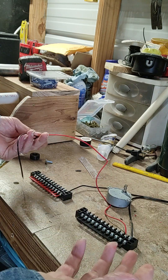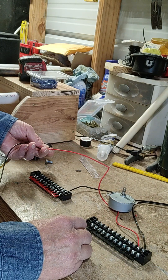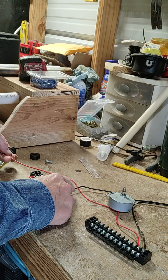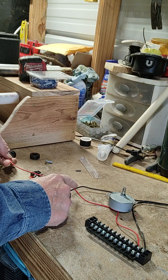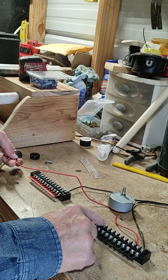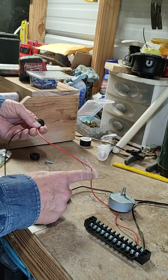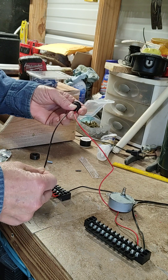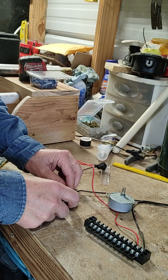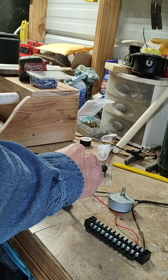You've got everything hooked up except one wire. To complete the circuit, basically it's got to do a loop — it was like connecting this wire to this wire, and this wire to this hot wire. It's just the strip's going to give you all the same — it's all powered. So what you do is the other wire off the motor goes to the switch. To complete the circuit, you'll connect this wire to the strip for this power source on this side.